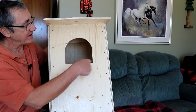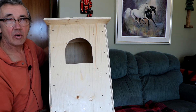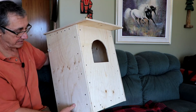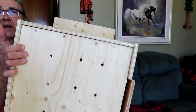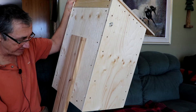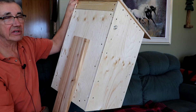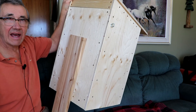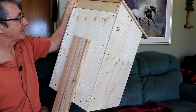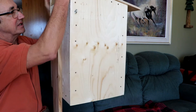The front board is 15 inches across, and the side boards are 16 inches deep because they sandwich the front, back, and bottom boards — an inch larger since I'm using half-inch plywood. It has a standard 7-inch wide semi-circular top cutout for the entrance, which is standard on the internet. I've left about 4 inches of roof overhang for rainfall, and the bottom has holes cut into it for drainage. For mounting, there are various methods online — some recommend a single backing board screwed to the tree, but as the tree grows it tends to push the box off.